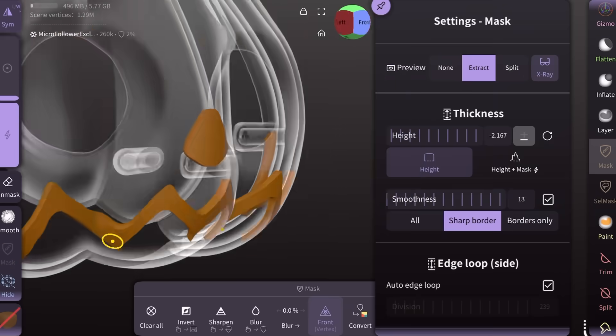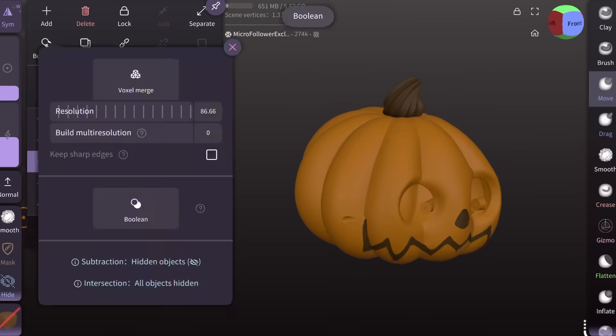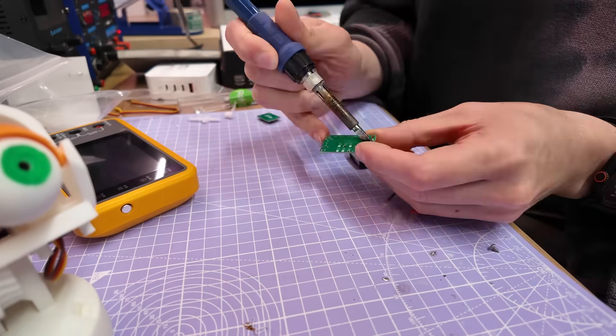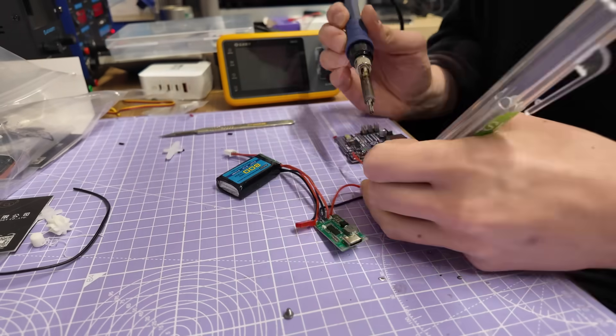In the end I made a skull version and a pumpkin version. For the skull I used a model already loaded into Nomad as a base, but I'm pretty pleased with the pumpkin design I made completely from scratch. The final part of the system was making it battery compatible — I wired up a two-cell LiPo battery into a USB charger into a five-volt regulator, so the whole thing can be charged up and run completely offline.